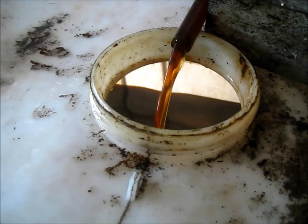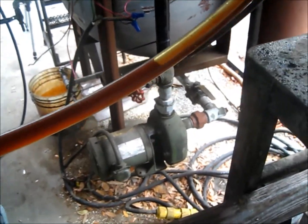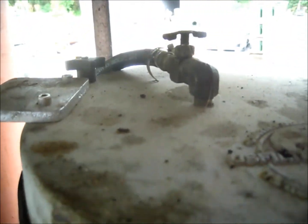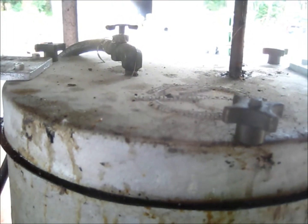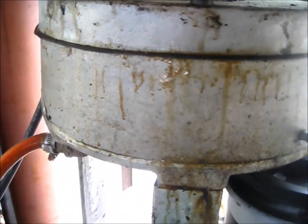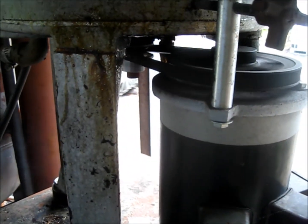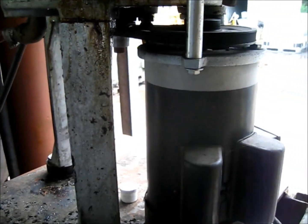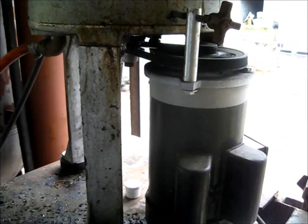Here's the oil coming out the end right here after it runs through the centrifuge. It goes through this system here, comes up and is fed in at the top. Essentially there's a spinner inside — a tub inside of there, similar to other centrifuges — with an electric motor. That motor works off a pulley system to increase the RPMs of the centrifuge, which is really cool because normally most centrifuges on the market work on a one-to-one ratio, which limits the RPM.